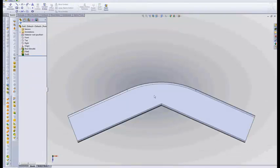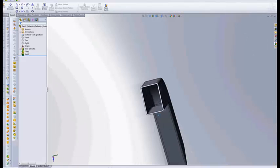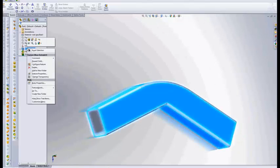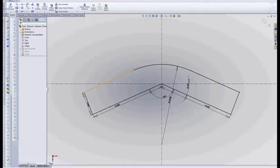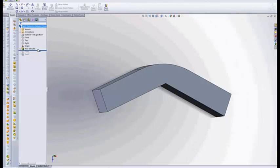I've created a new part. This is the profile — our bent tube. It's a 2x3 12-gauge, so it's 104 wall. What I did here was I just went in and created a sketch on the top plane that represents the profile of the tube. From there I extruded it into a block, put the fillets in for the corners, and then shelled it out.